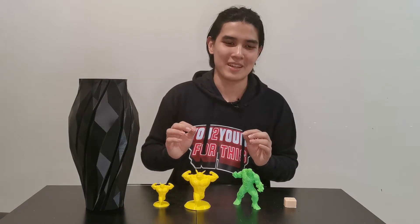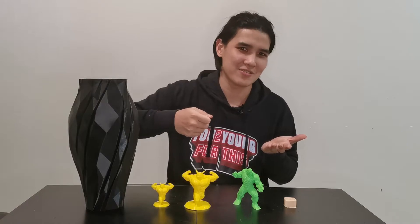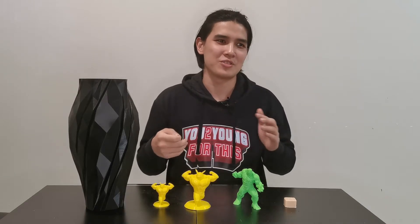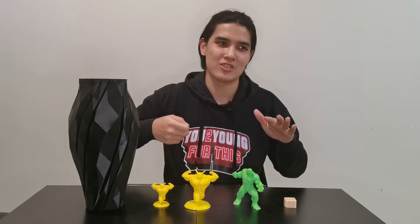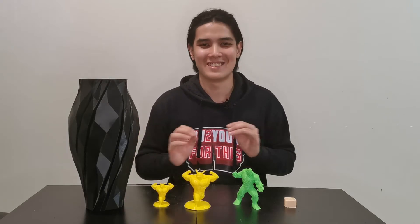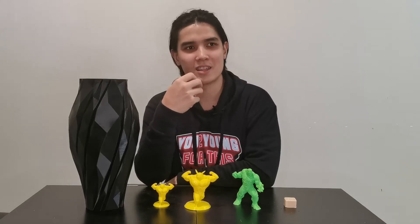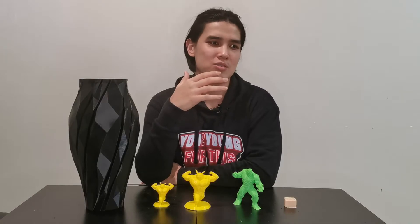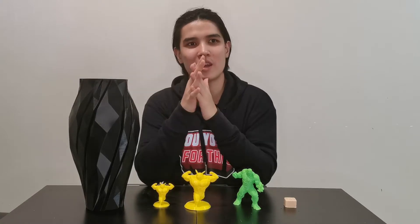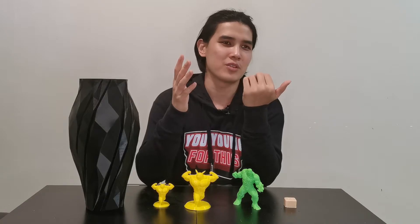For the calibration part of the printer, especially the printing bed, I practice using a piece of paper and slide it between the nozzle and the bed until it has some resistance. I do this at the four corners of the printing bed and also at the center until each point has consistent resistance against the paper. I'm pretty surprised at how user-friendly this product really is — it only took me 2 hours to build and assemble until it started its first print. Without making a video like I did, I'm confident that everyone can do this under an hour.